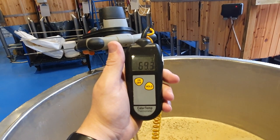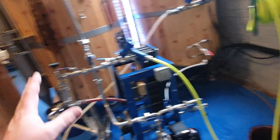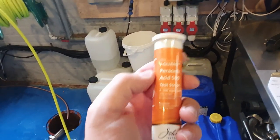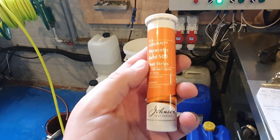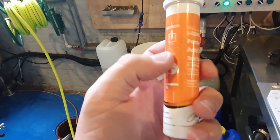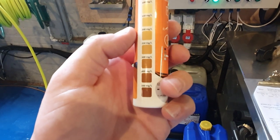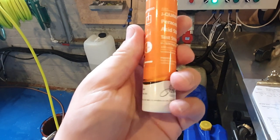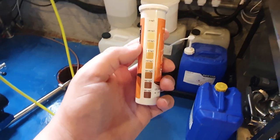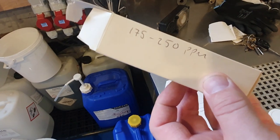If you're using Persid 5 or Persid 15 to treat your tanks for sanitation, it's probably worth picking up a set of these test strips. They're available from Murphy's and Niche Solutions. What they do is measure the milligrams per litre, or parts per million, of your acid concentration. Very simple dip test. We found that we were using way too much acid in our mix. We want to be between 175 and 250 parts per million.